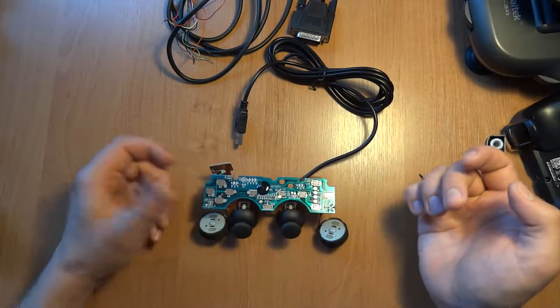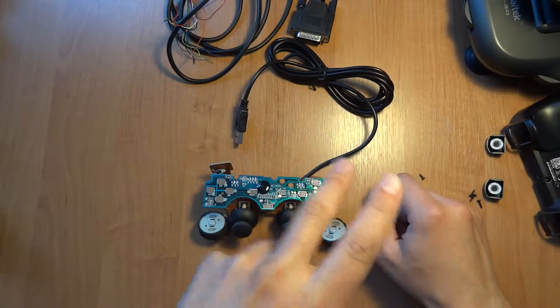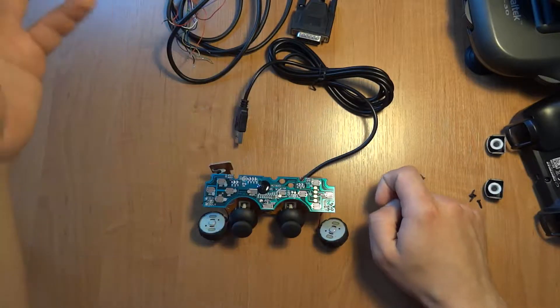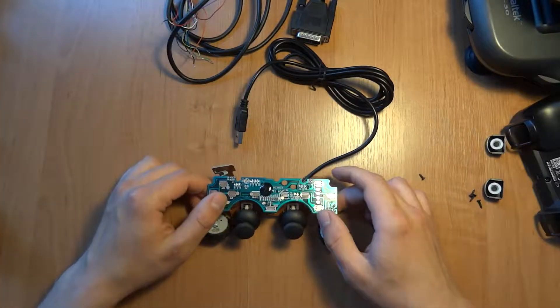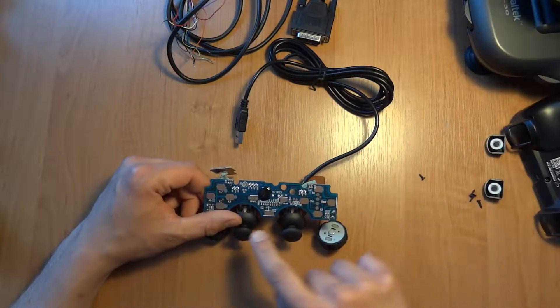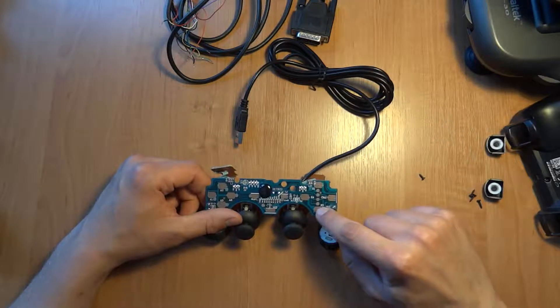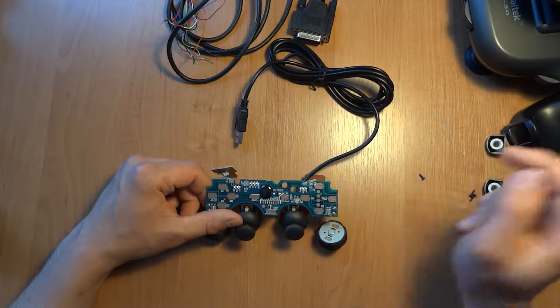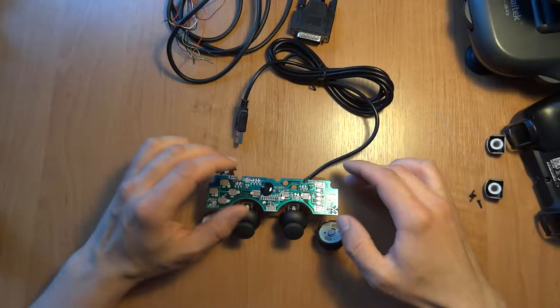What I basically did: on here you have a more simple design, because the board I used was also for the PlayStation connector, which I removed because it caused all kinds of glitches when using USB. As you can see, they all have simple test pins so they can be connected directly - pretty easy.